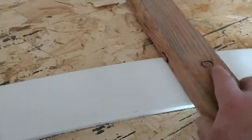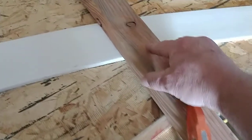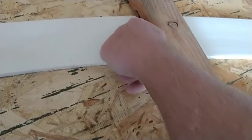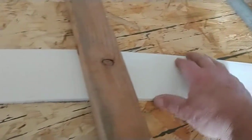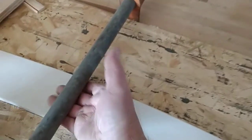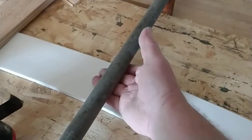Also, on these boards here, they clamp completely across my bench. What they do is they have a slight gap of about a sixteenth of an inch underneath so that this PVC can move freely. If I was to take all these other clamps off, this PVC would actually move underneath these boards. I also had these clamps set up so that they're arched — there's space underneath so that the heat can travel underneath them.